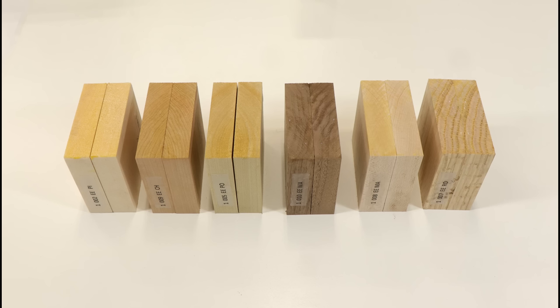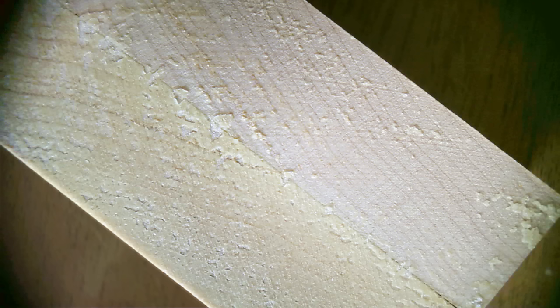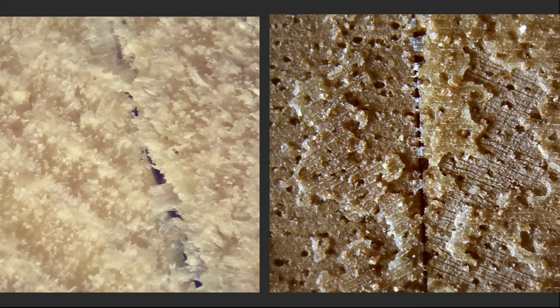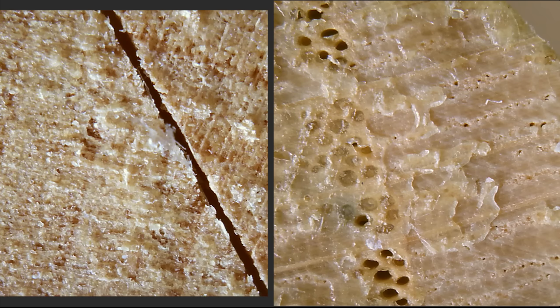Take a look under my microscope. If you break open end grain joints and look at them with your naked eye, you really can't see much difference. However, if you look more closely, you can just begin to see differences. Notice how the glue pulled away from one side of the joint on this maple sample? The joint was very strong, but when it failed, it separated almost completely from the wood. This broken joint in pine is a totally different story — both sides of the joint have glue adherent in a very uniform pattern. When we look at high magnification, way more differences begin to appear. Compare this pine joint on the left with the maple joint on the right — completely different. Or compare pine to walnut — radically different again. Or to oak, which has huge pores that often, but not always, grip the glue firmly. Cherry is different yet.